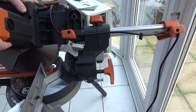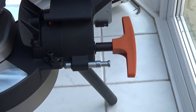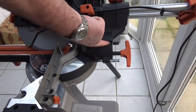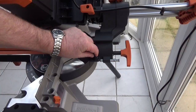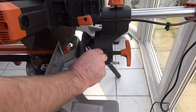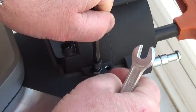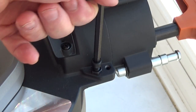Slack that off and push it over until it stops. The adjustment for the vertical setting is a physical stop between the set screw and a lug. Slack off the locking nut to allow adjustment. Because the gap was at the bottom of the blade, the top of the blade needs to move that way. There we go — that's at 90 degrees. Very simple to adjust. Once you're happy with the set screw position, keep it in place with the allen key and nip up the locking nut to secure it.